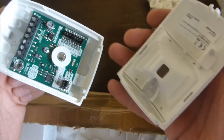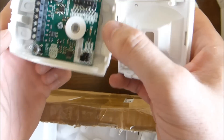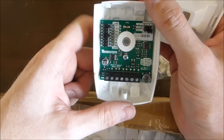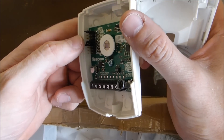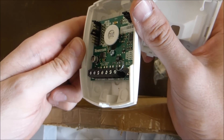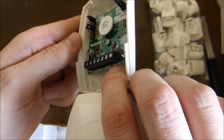Cracked it open. So what we have is basically a lens here which goes through there and an infrared detector here, and various circuitry to prevent false triggers going off. A few dip switches which are connected, and basically we have wiring here of minus 0 volts, plus 12 volts, alarm, tamper, and the LED.